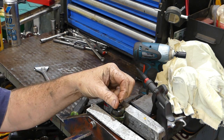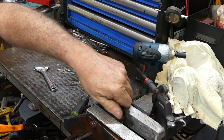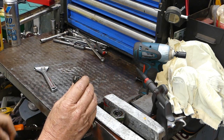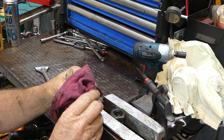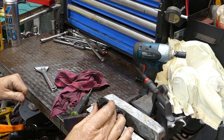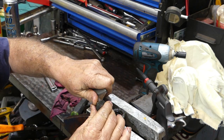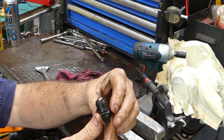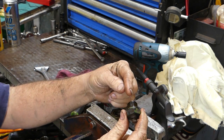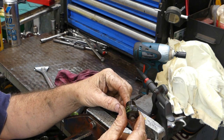I can't remember if the 3130 has it. I've loosened this off earlier and this centre here just comes out — it's spring-loaded a little bit. When we look at the end here, this nut is plastic — you can see it's just a neoprene plastic. The reason for that is we can have a probe through here that's not earthed out onto the tractor. When the filter bypass opens, if there's need for it to pop up and touch here, it earths out and that completes the electrical circuit up to your dash.